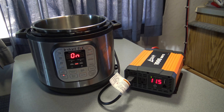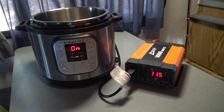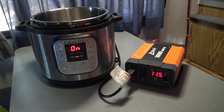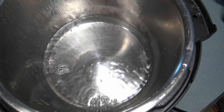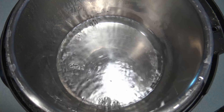It's still working — very interesting. I'm just letting this water warm up. I can feel the bottom of the pot is getting hot, and we're at one kilowatt. So far so good. I'm going to go ahead and say the answer is yes — you can run a standard six quart instant pot using the Ampeek 1000 watt modified sine wave power inverter. As you can see, it's working just fine — we have a nice solid boil.